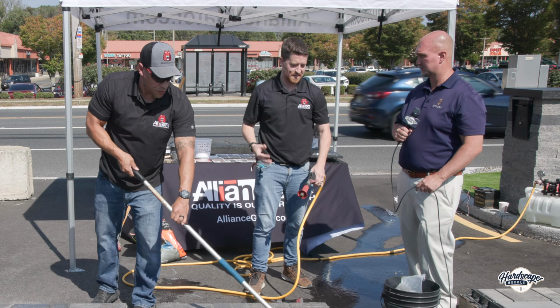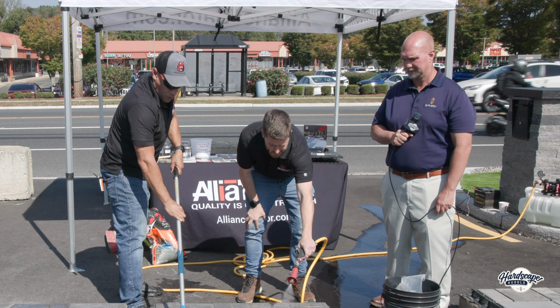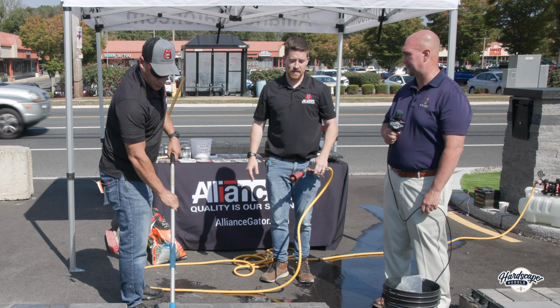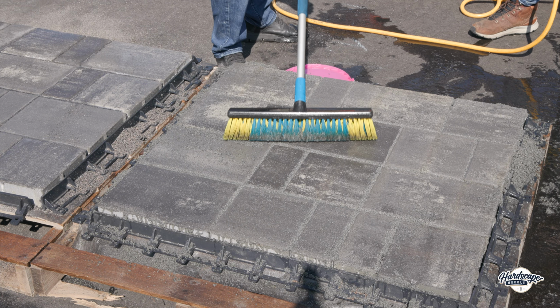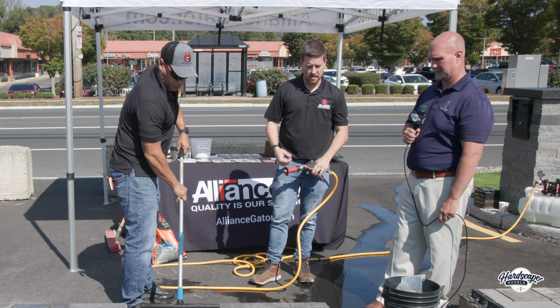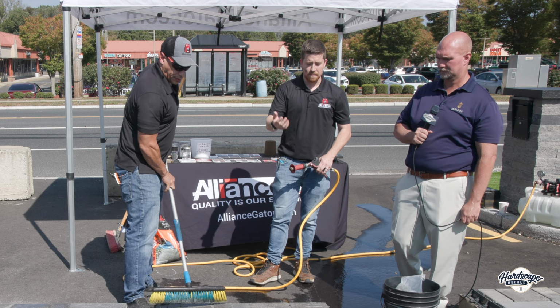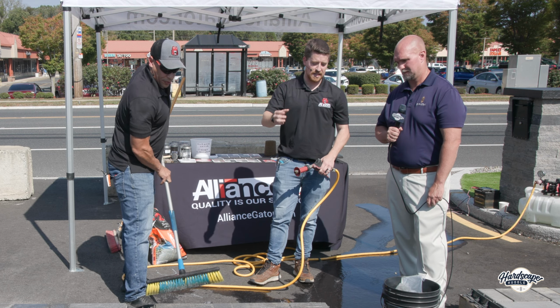It's going to be more of a choice type thing. It's situational. Can you use this on wet laid products? No. Such as bluestone or something like that? Once it's wet laid, you need a drainable base for this. You need a drainable base for both, honestly. A concrete sand. But more and more guys are using it when they're using a number 8, number 9 stone chip base. One of the key benefits is it is permeable.